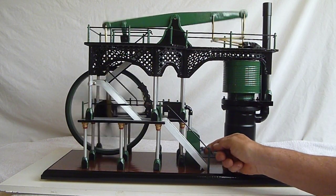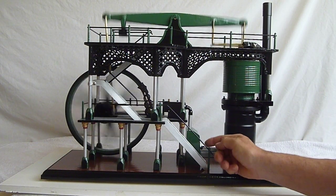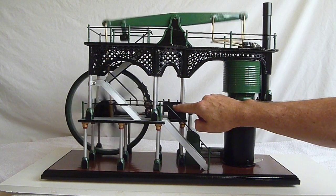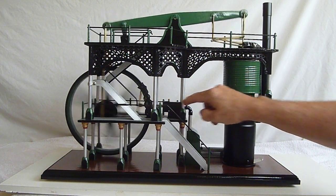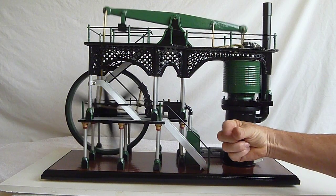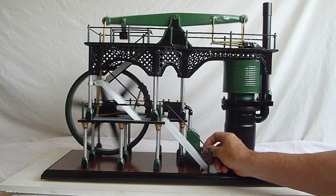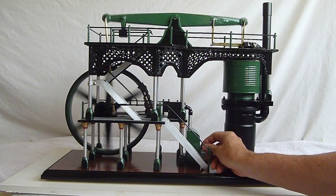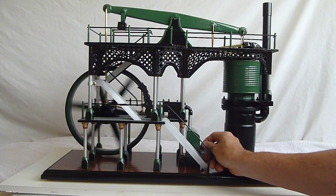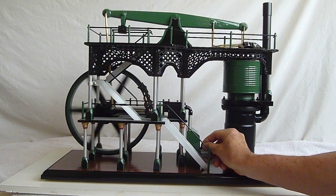I've managed to make a regulator that, by turning the handle, pinches a pipe that comes through this box I've made up. Aluminium piping brings the vacuum from the displacer up to the power cylinder, which is a car rear brake wheel cylinder that's been modified. Inside here I've got a small section of rubber hose — two little levers pinch together and close off the air through it, so I can wind the speed down. The slowest I've managed to get it running was 40 RPM, timing the beam movements against a stopwatch. If you go a little bit too far, you can pinch the hose so far that it stops the engine, which it nearly did just then.